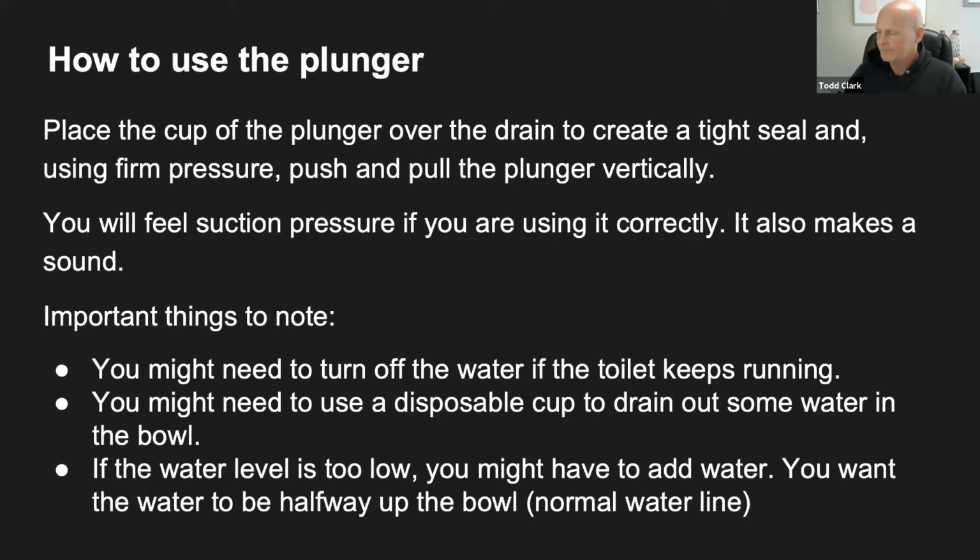That's a great question. So Donnie says it happens every day. That would be something where, like I said, you take the lid off and look at it, and then flush the toilet and see what happens with that flapper. And if that rubber flap doesn't close, that might be the problem.